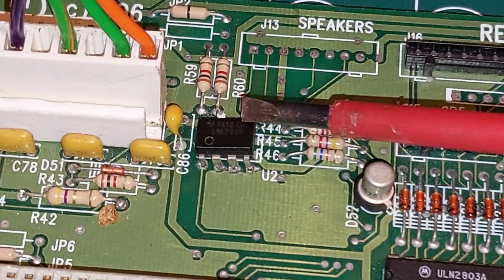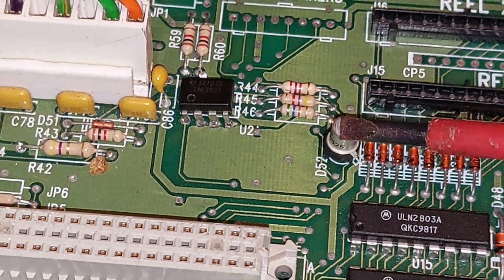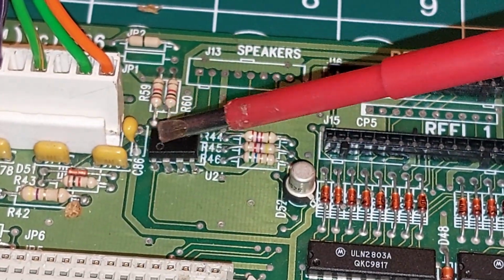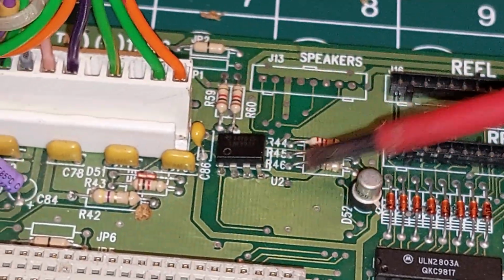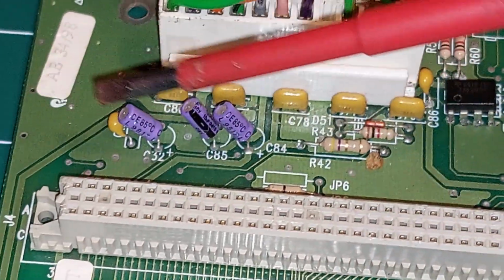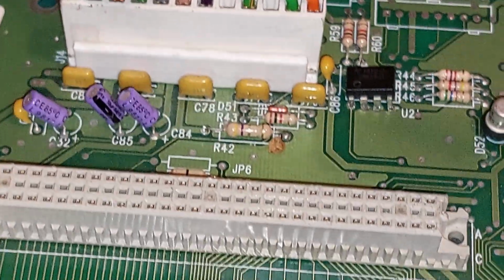Right away at the power plug, I see something familiar. I see a LM393 here and a ZN404 here and some resistors and stuff, some capacitors. And that is very likely to be a voltage sense. Missing pulse detector, maybe. See, you already figured out one circuit for yourself. These are power filters, obviously. They're tied to the various lines.